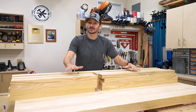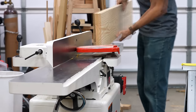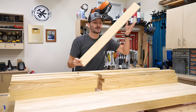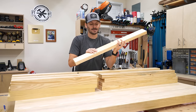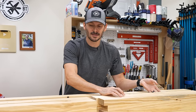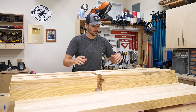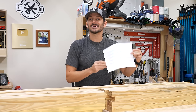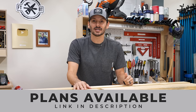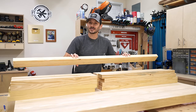I went ahead and cut all the parts for the base, using the planer, joiner, and table saw to get there. I basically got these to about the same size as a typical two by four, except these look a lot better. I do have a few knots in there — I wasn't as picky on these because they're not going to be on the top. I do have plans available if you want to build your own workbench; I'll have a link below. Now I'll get into making the legs, which will show how those go together to support the stretchers and the top.